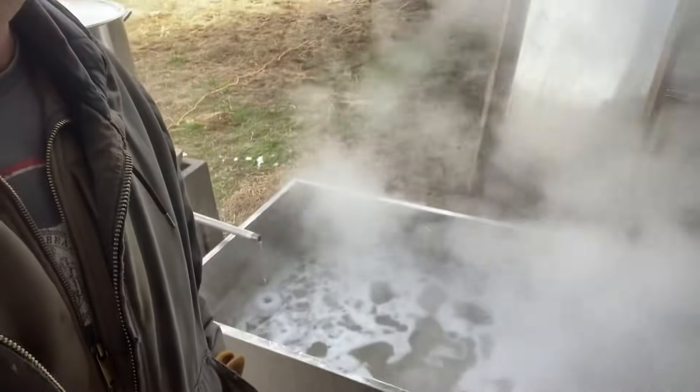So we turned 66 gallons into 25 gallons of sap in one pass — one pass over those four filters. We're moving sap through the RO at about 10 gallons per hour, and then we do another 8 to 10 gallons per hour on the evaporator. So when we have both going, we're cooking with gas — about 20 gallons an hour total.